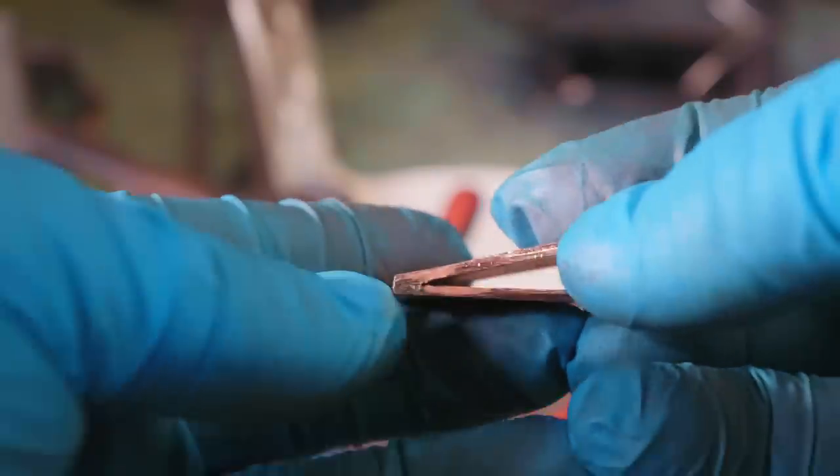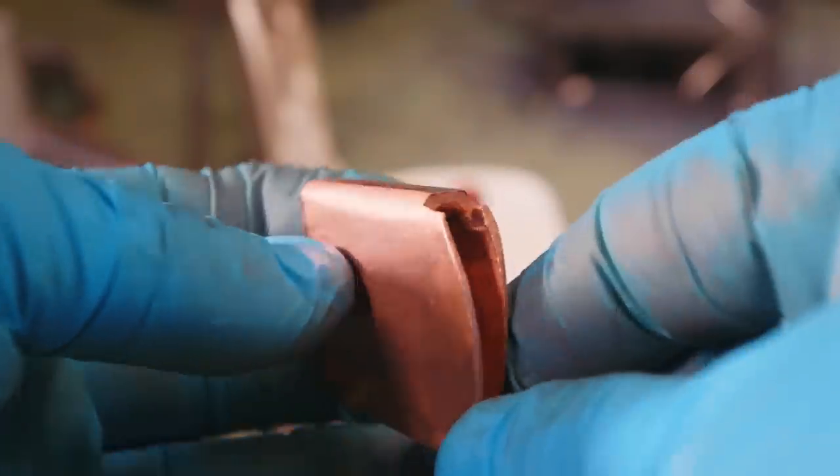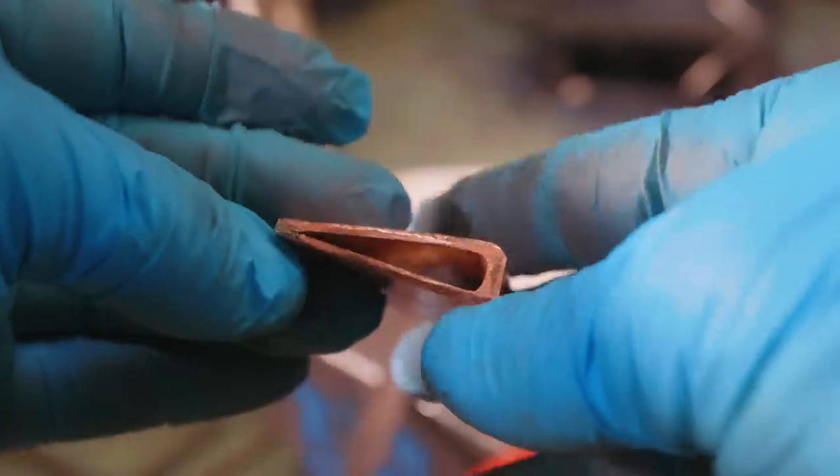The spacer does not look super clean, but this habaki, I am completely thrilled and completely shocked that I was able to pull that out of a piece of 16mm round bar. And all it needs now is some final tweaking and polishing from 120 grit up. And so it's back into the grinding room for a little more of that.